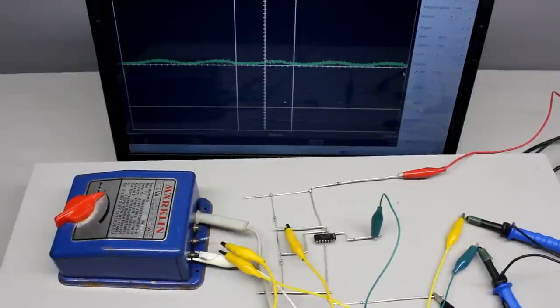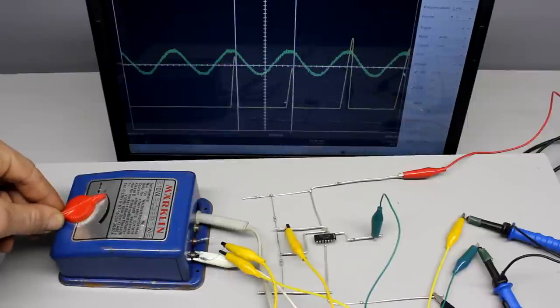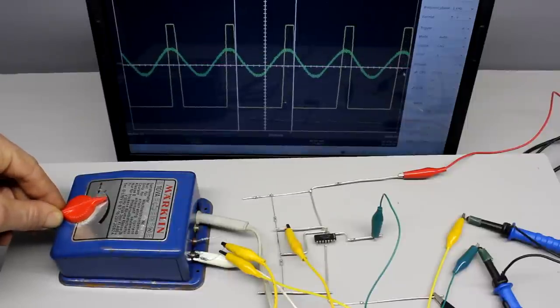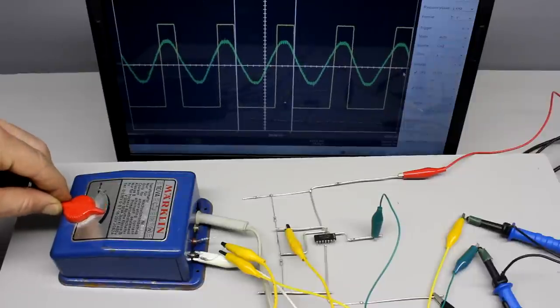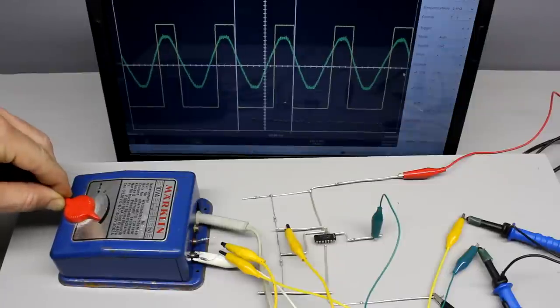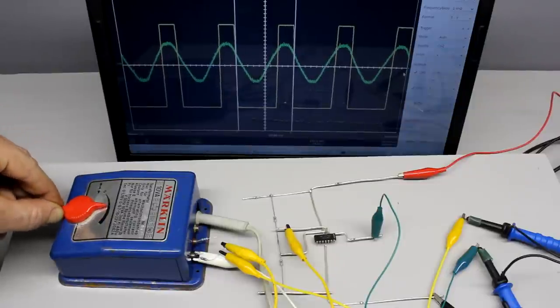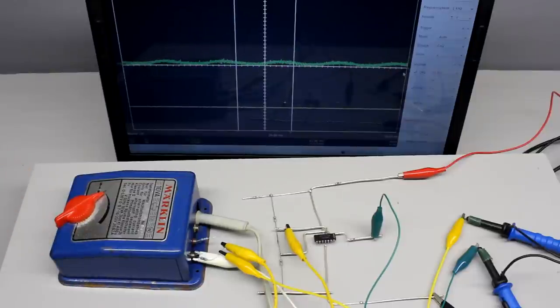Without any further wiring, an operational amplifier amplifies the voltage drop between the two input clamps with the open loop gain. If your intention is to amplify a sine wave signal, an operational amplifier with a gain of more than 100,000 is nearly useless — a sine curve with a peak voltage of just 100mV between the input clamps becomes a square wave signal at the output clamp.